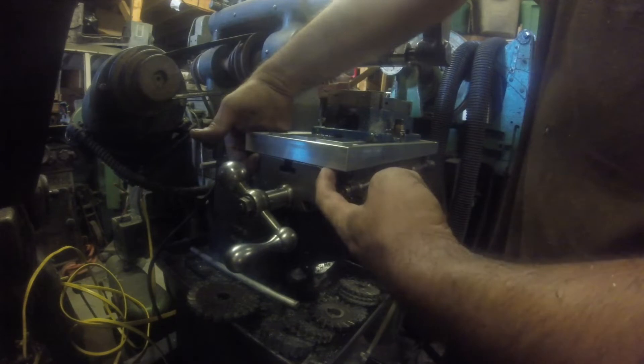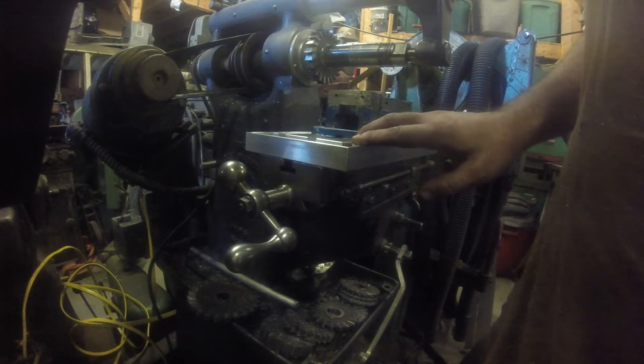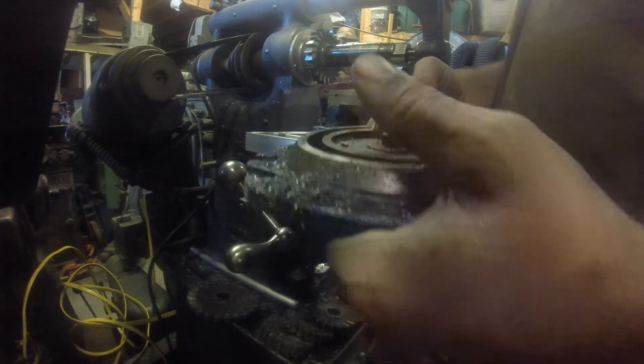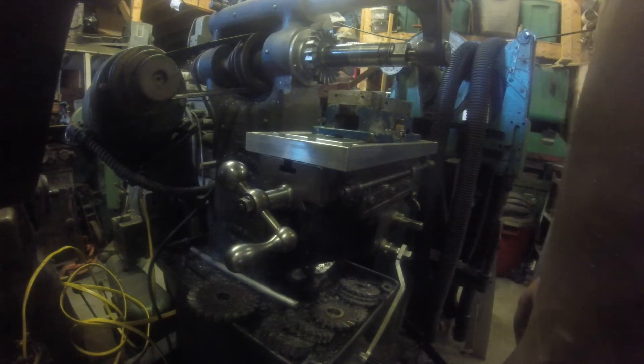The original table is about four inches wide with one slot — I could mount the vise in one direction but not the other without using the swivel base, which I had to keep on there most of the time. With this plate being one inch thick, I no longer have to run the swivel base to have the vise parallel to the spindle or the arbor. It took up some space but I also got rid of that spacer, so I think it's about a wash.